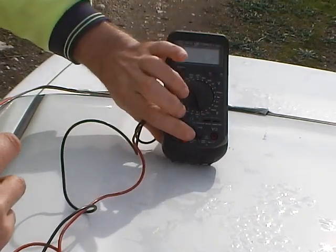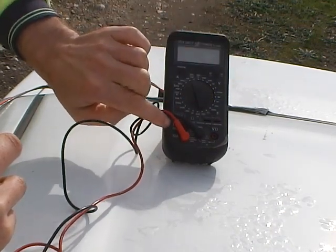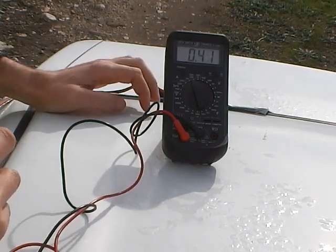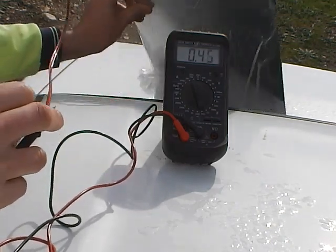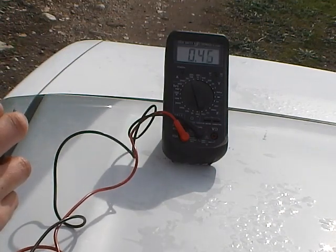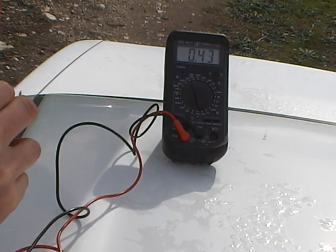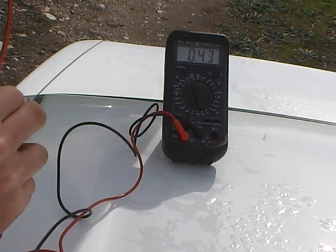I've flicked my little plug from the volts and ohms to my amps. Now I've only got a lousy 0.4. If we move that around — the thing is the sun's half covered anyway. Before I actually had it at 1.06 when the sun started to come out and it was bright enough, but it's been a lot brighter obviously.